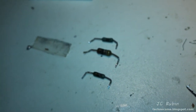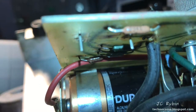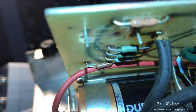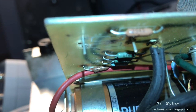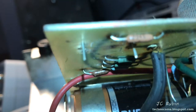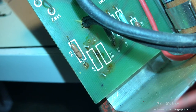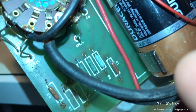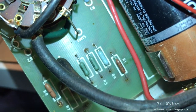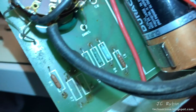I'm going to see what resistance we need by bridging across a resistance box to get the value we're looking for. I've used one of the pairs of holes to attach some leads — those two metal pieces hanging down go to nothing, but they allow me to attach alligator clips to hook up to the decade box. R7 and R8 are only for the times-one measurement, so I'm able to leave those out of circuit and test the calibration.